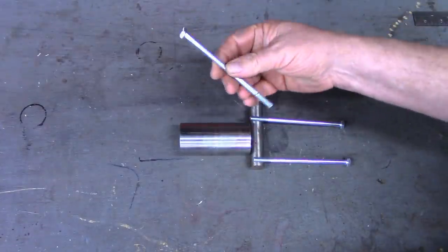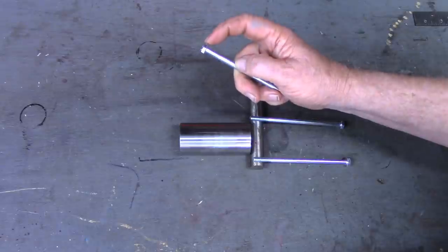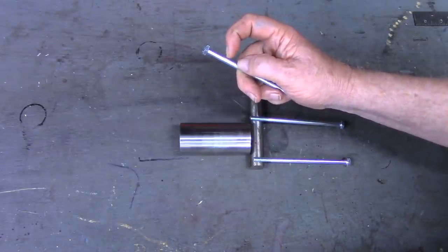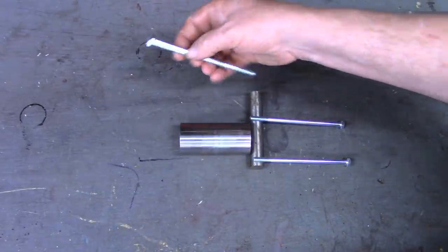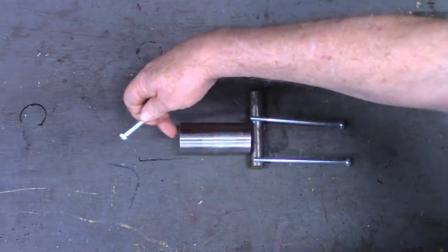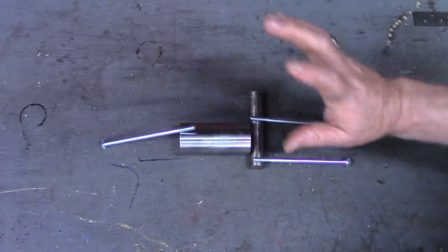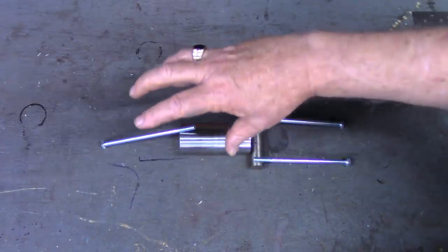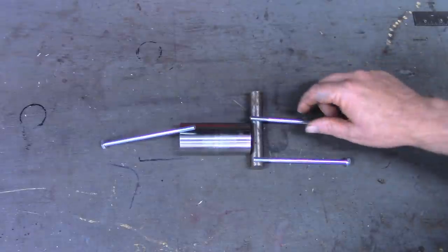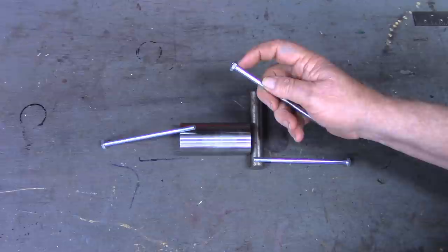Finally, another one of these 6-inch quarter 20 rods, I'll take the head off of it, again turn a point on the end of it, and probably put a 90 degree bend in it. And then this end will be threaded for the quarter 20, and that will go into that end. That'll give me an adjustable third hand and get this weight up high. So I'm going to start probably on the lathe first, taking these, I'll go to the bandsaw and take the heads off.